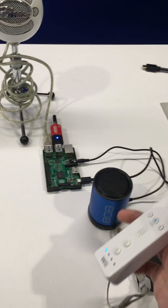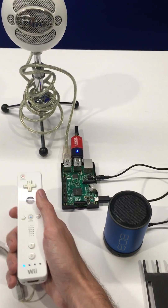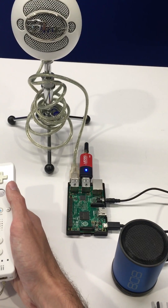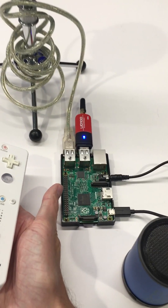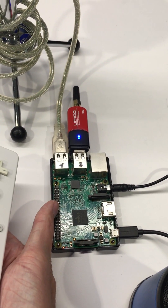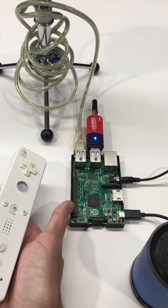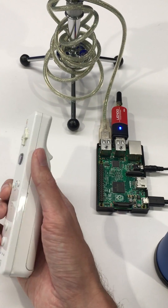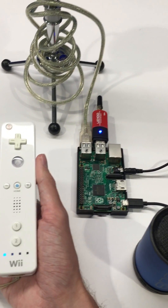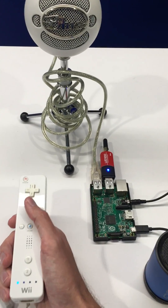And that's basically it. It's really cool — you can ask her all the same questions that a normal Amazon Echo can. It was really cheap because I already had the speaker and the microphone laying around. You can get it working on a Raspberry Pi 3; this one's a 2, so you wouldn't even really need a Bluetooth or Wi-Fi dongle as that comes built in on the newer Pi. All you would really need is a hardware button for the GPIOs, or a Wii Remote if you have one laying around — this is the original Wii Remote from 2006 — and a microphone and a speaker. Thanks for watching.